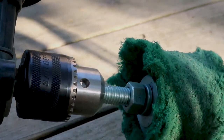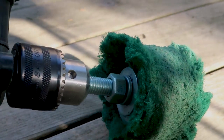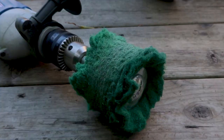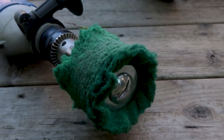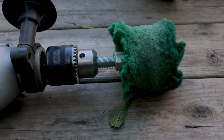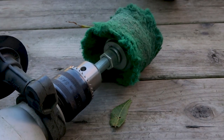You can see the bolt held really well. It seems I needed a half-inch bolt, the lock washer, and the big washers — that seemed to work. The smaller, thinner bolts didn't work very well — they just bent and came undone. I'm not sure why, but it seems that this is how it works.